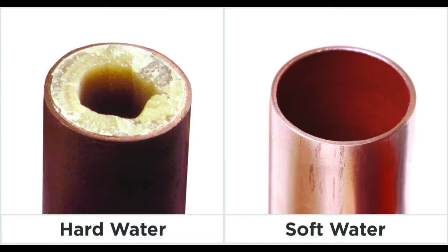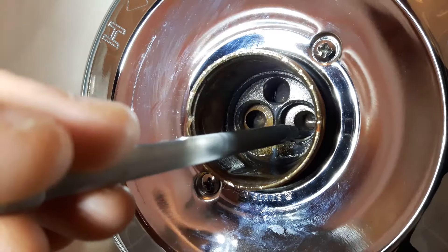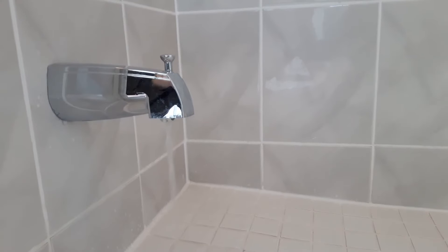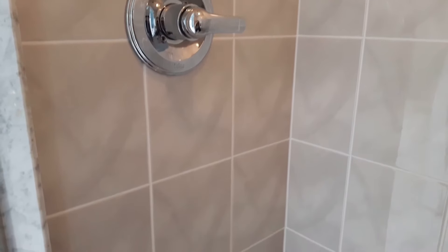The first thing I did was to remove the cartridge and purge the lines. The water came out at full pressure through both the hot and cold water lines which feed into the cartridge. I tried installing a new cartridge, but the water pressure at the spout remained the same. So I knew the problem was most likely a hard water buildup somewhere in the pipe that connects the handle to the spout.